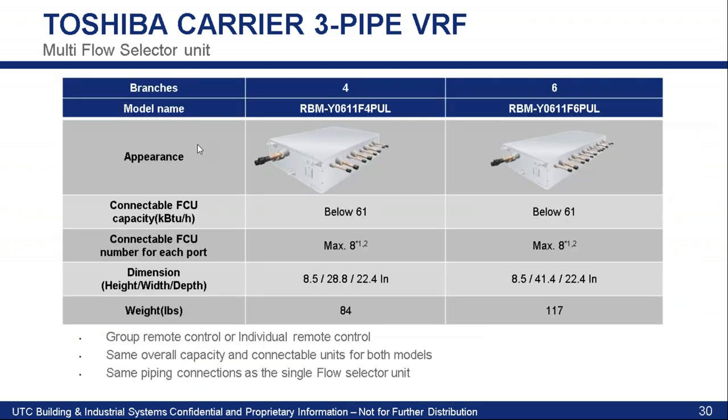We also have larger boxes with multiple ports — a four port and a six port. These need separate power sources. The capacity is five tons on both. A question from Rishi: can we add electric heat to the rooftop in addition to VRF heating? Yes, definitely — you can do an external duct heater. The rooftop can be ordered with electric heat in the rooftop or in the duct, but you cannot get it with gas heat.